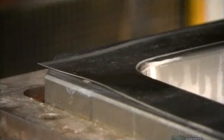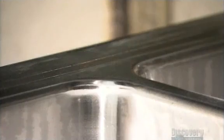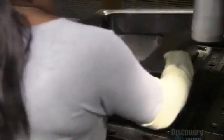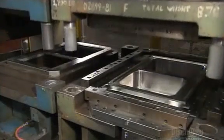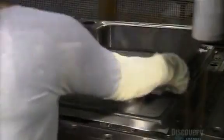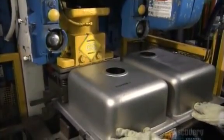It's time to give the rim of the sink some shape. A die forms recesses along the sink's perimeter. The recesses give the sink a sleek look and collect water runoff. Another press trims the rim and gives it a bevel finish, which softens those rough edges. Using a punch cutter, they pierce the back rim of the sink to make holes for faucets and a soap dispenser.